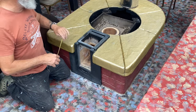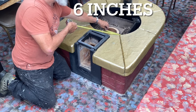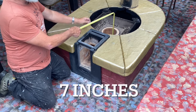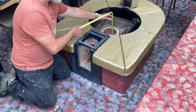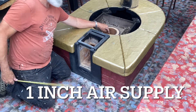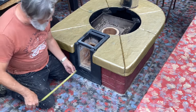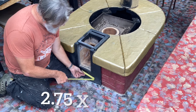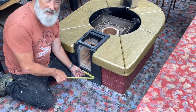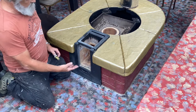The system is 6-inch size, so the round exit hole is 150 millimeters, and the depth here is a total of 7 inches to the top of the vermiculite. The air supply that runs underneath the firebox has a 1-inch exit, and the dimensions of the slot that runs underneath are 2 and three-quarter inches, which is about 68 millimeters.